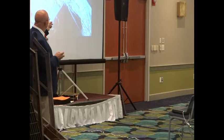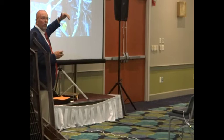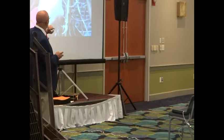Here, Mike, at the scene, again, being an expert witness, and I was on this case, the key here is that at the very top where they came off, four stories up above, this is the back. All three got hurt, one died. So the key while I'm showing you this is because the through bolts got eaten into the building. So it's not that the fire escape failed, it's that the connection, the through bolts into the building were eaten by water.